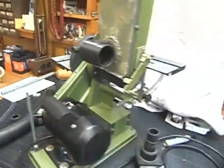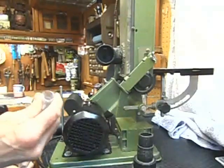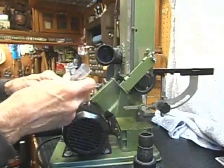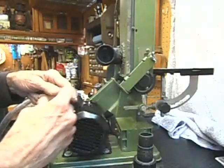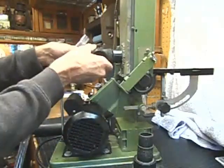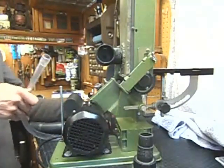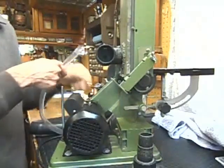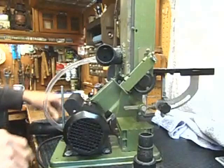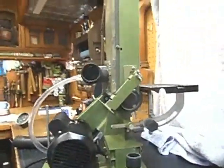So that can stay there — I don't have to move that. On the hose, I used a three-quarter by five-eighths hose, heated it up with a heat gun, and stretched it over the fittings, so now they just plug in. Normally I use it in the vertical position, so I plug one end into the disc sander and this end into the T adapter. This hose doesn't like to be folded very much.